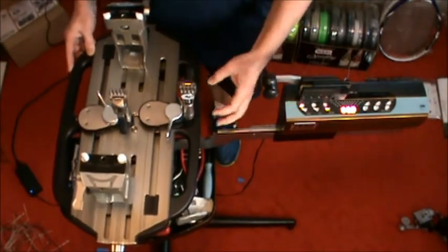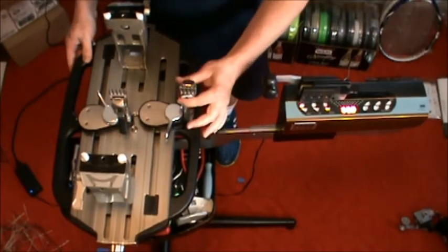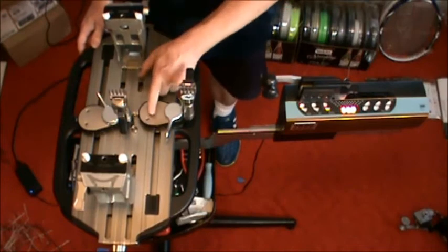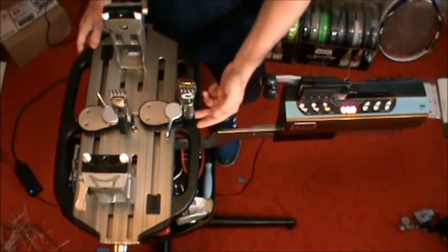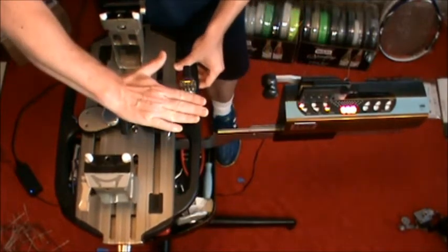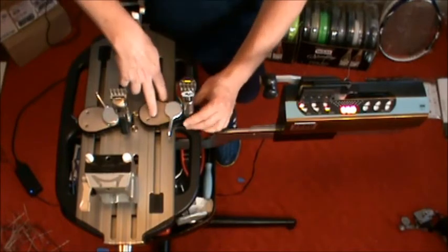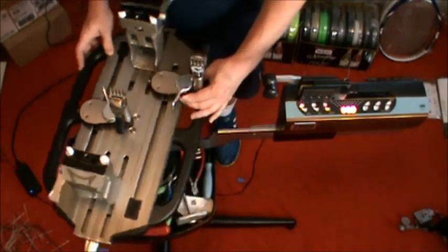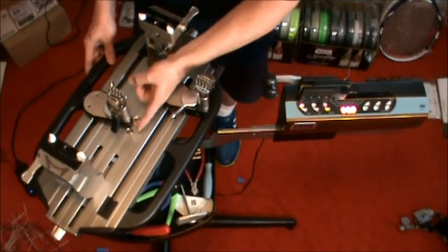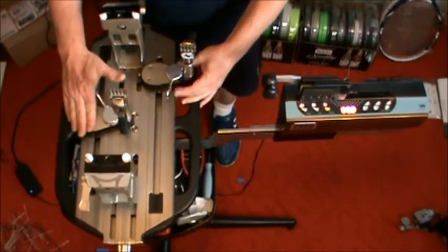And so basically the path of least resistance, if we don't have the base clamp locked at all and we pull it this way, it has nowhere else to go but to line up. And we will lock it. But if I use this base clamp that's closer to the tension head, there's nothing supporting the underside of it here, and so there's a small risk of it getting pulled downward when I apply tension and flexing. So by putting this one over here, I have turntable directly supported underneath the clamp. So that's why I'm using the one that's on the far side.